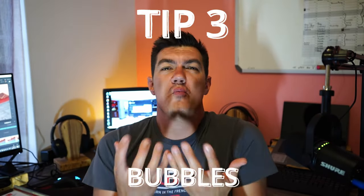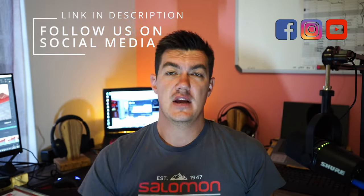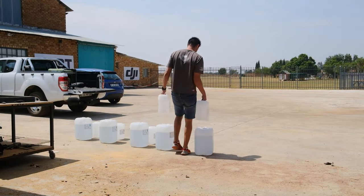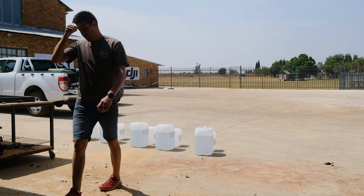Tip number 3, air bubbles. The one question we get so much from all the people that are watching our videos is, how do we deal with air bubbles? Very easy. This section I'm going to divide into 4 quick tips. Number 1, before we start planning and mixing and pouring our table, we would put our part A and our part B resin and hardener in the sun for about 2 to 3 hours to heat up the epoxy. Then we will mix them together. Then it makes the epoxy more liquidy, meaning the air bubbles are going to rise up much quicker.